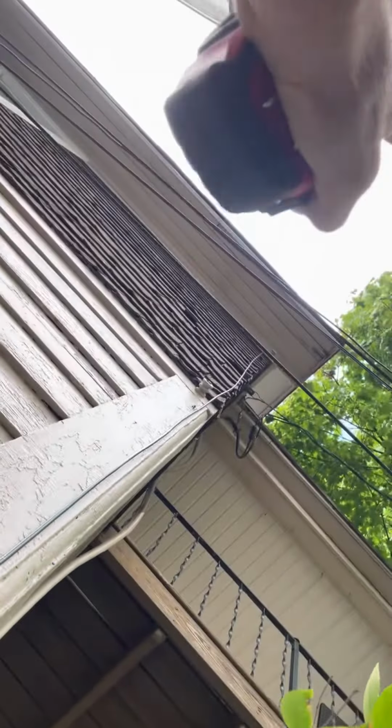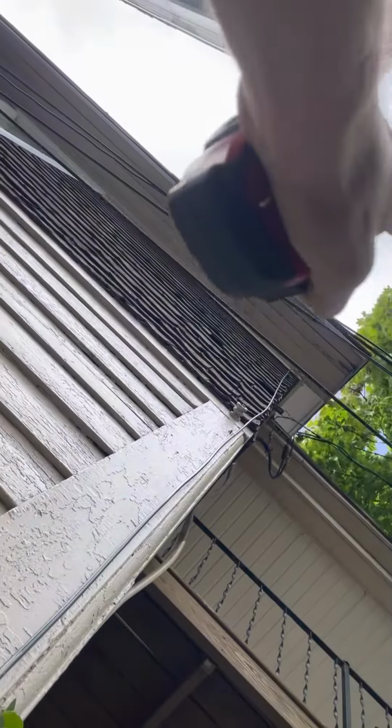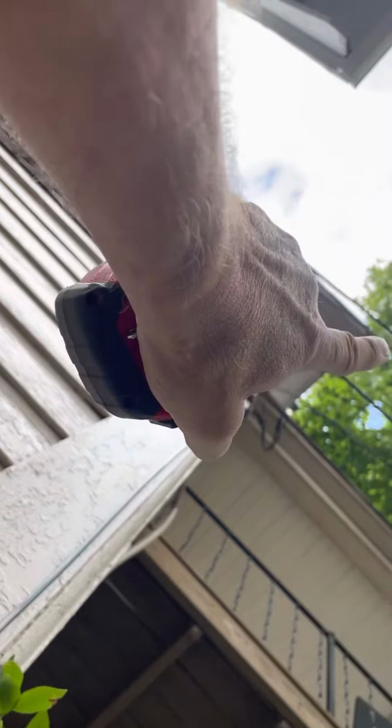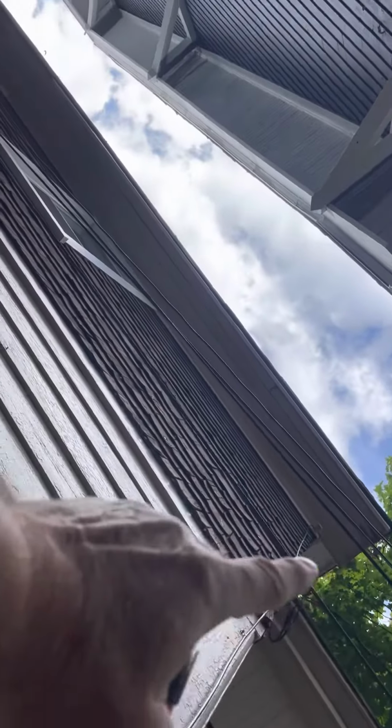You're gonna come out 4 foot with a 2x6, going this way, cantilevering out, and it's gonna bolt into the sidewall. Okay, and then you're gonna come down with an angle, bolt it into the sidewall also, and then another gusset. So you're gonna do 2x6 coming out 4 foot there, 2 foot onto the sidewall, and then coming down with an angle piece. Okay, and then what we're gonna do is we're gonna come across from there to the wall with another angle, so that holds this stable from waggling.